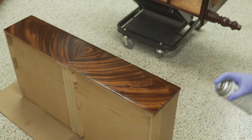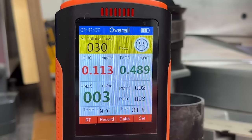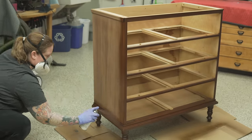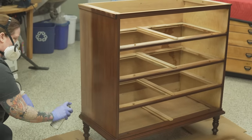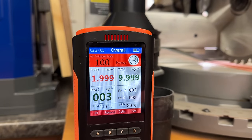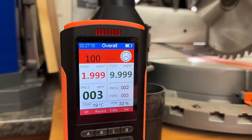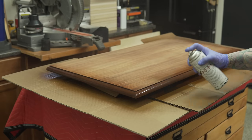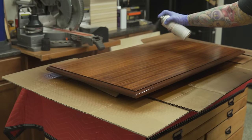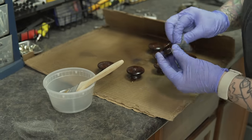I've touched briefly on the toxicity of lacquer before. I sprayed two drawers and already the pollution level in the room has gone up to 'poor.' By the time I'd finished spraying the cabinet, we're in the danger zone. This is something that's very important — even if you're just spraying a tiny bit of lacquer, primer, or spray paint, or using strippers, this stuff lingers. And because it's clear you don't really think about it — you don't see it. But there's something astonishing coming up shortly about that.